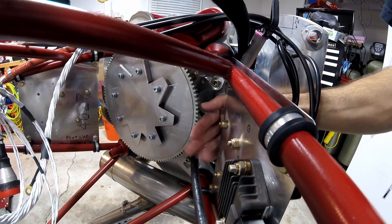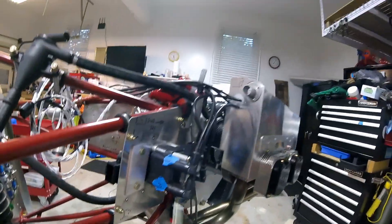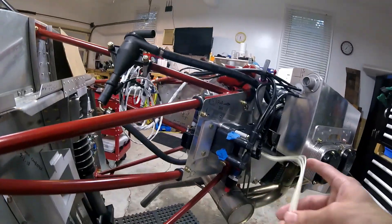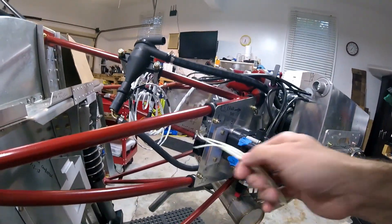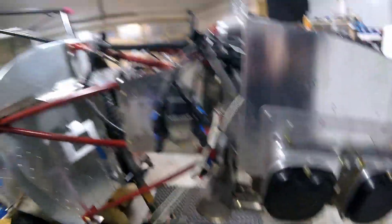I did that because it was just too close — I felt like it was too close to the flywheel right here, and I just didn't like that. I figured it'd be harder to access and connect later. So we have plenty of wire coming out of the generator, and what we can do is just make the connector go around like that, and it stays out of the way of the flywheel and all that stuff.